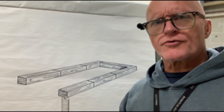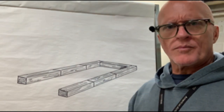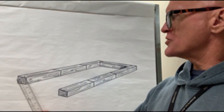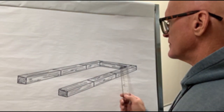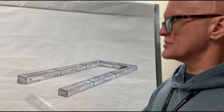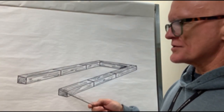I wanted to walk you through what I did prior to the shipping container being delivered. I had about a week's notice before it was scheduled to arrive, so I graded an area on our property as close to level as I could get it. I had some railroad ties on the property already, so I laid those out in the shape of a horseshoe — outside to outside matching the exact exterior dimensions of the container. I then spray-painted a line to mark where they were laying, moved them, dug a trench, and buried the railroad ties in the ground leaving only approximately three inches sticking above the soil line.